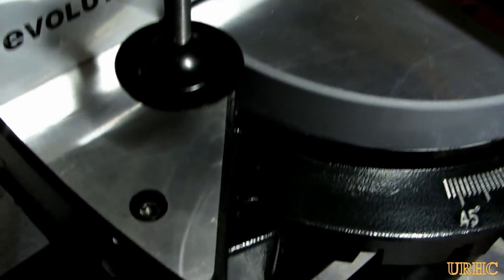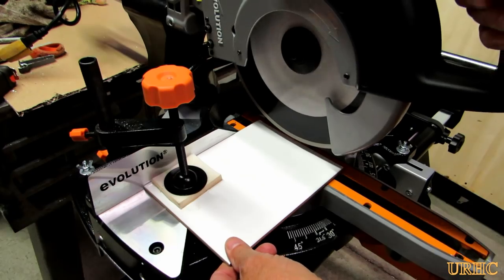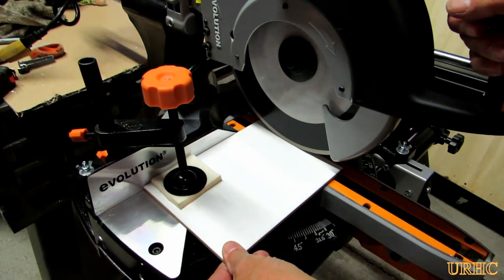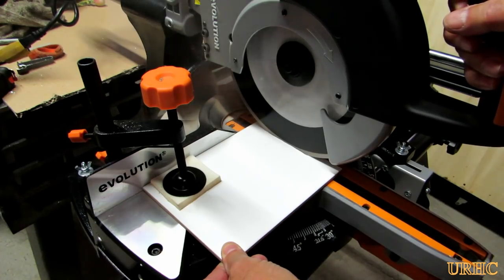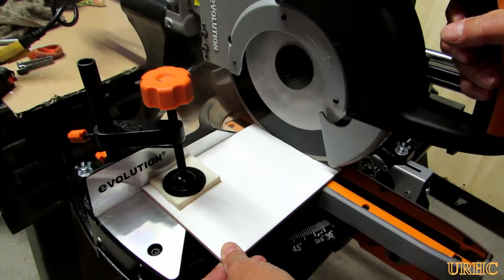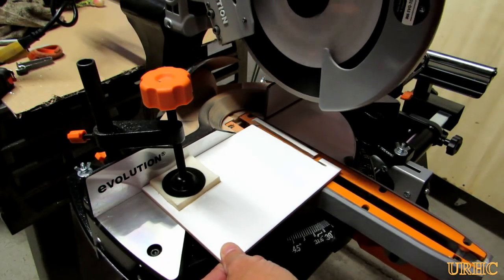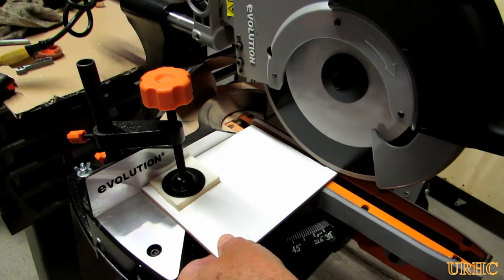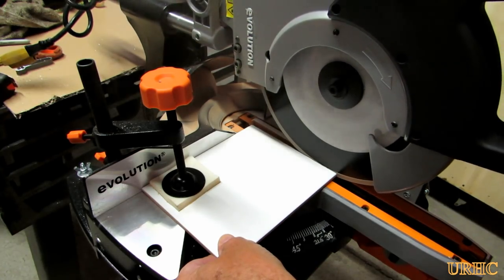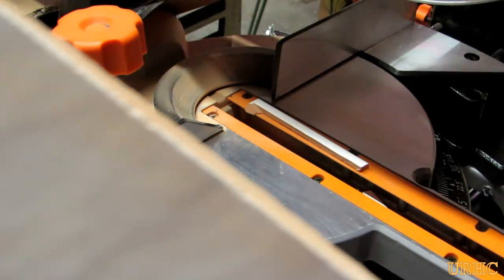About the only thing I'm going to have to do is a little work on the clamp. They also sent me a diamond blade that's not usually included with the saw. I have some really highly polished Italian ceramic tiles that are really tough to cut, so I decided to try cutting one. The ceramic is just so brittle — it usually chips right off with a diamond blade. I'll be using this saw for some tiling jobs in the future, so I wanted to try it. I locked the saw in for the first part of the cut — I didn't want any shake — but it just cut it beautiful, cut like butter. Very little chip-out. I was really amazed. I will try scribing them for when I'm doing real tiles, but it did do a wonderful job.